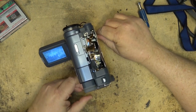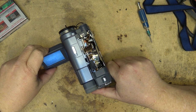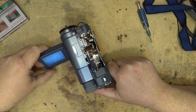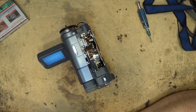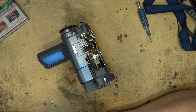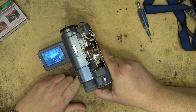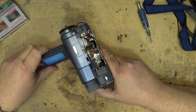We had no picture before and we have a picture now. I don't know if there's anything else wrong with this camera. I have a feeling they probably got a damaged tape that went through it and contaminated the head. This is a wedding I did years ago - I'll keep the screen tilted down. I was shooting on Hi8 back in the early 90s; I switched to DV when it came out in the mid 90s. Everything else seems to be working - on fast forward now the picture looks normal, no more black bars, and reverse search looks good too. Alignment looks good.